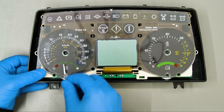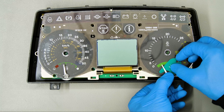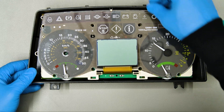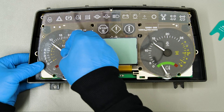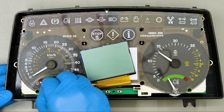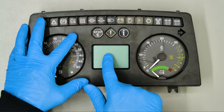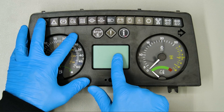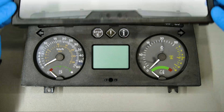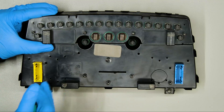Put back the smaller needles and, with the head of the Minitool's shim, fit them at the right level. Speed and RPM needles do so by their own internal stop. Bring all the needles back in their original position. Fit back the front cover making sure the LCD is perfectly fixed. Put back the buttons and, lastly, the front panel. Tighten the rear screws.